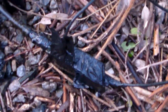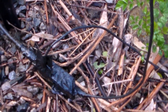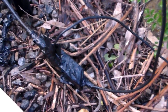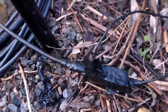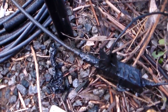Down here there is a 9 to 1 un-un. Because the impedance of this wire antenna is quite high — I think it was about 450 ohms, something like that when I looked at it with the analyzer, depending on which band it was, it was around 400 to 450 ohms. So what I did was put a 9 to 1 un-un in there just to get the impedance down to something that wasn't too bad a match for the 50 ohm coaxial cable.